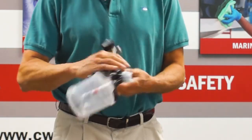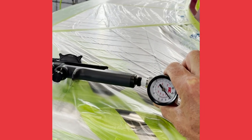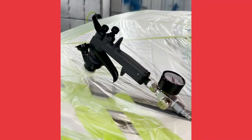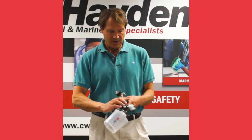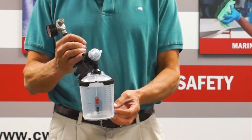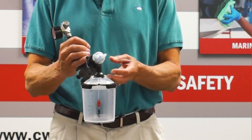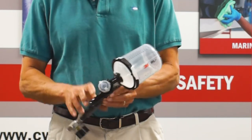Once you apply pressure, it's HVLP. I usually run it at about 20 pounds — it sometimes depends on how thick the product is, but 20 or lower. Once you have the product in there, open the air all the way and pull the trigger, and you will actually bleed out any excess air in the bag and create a closed system.